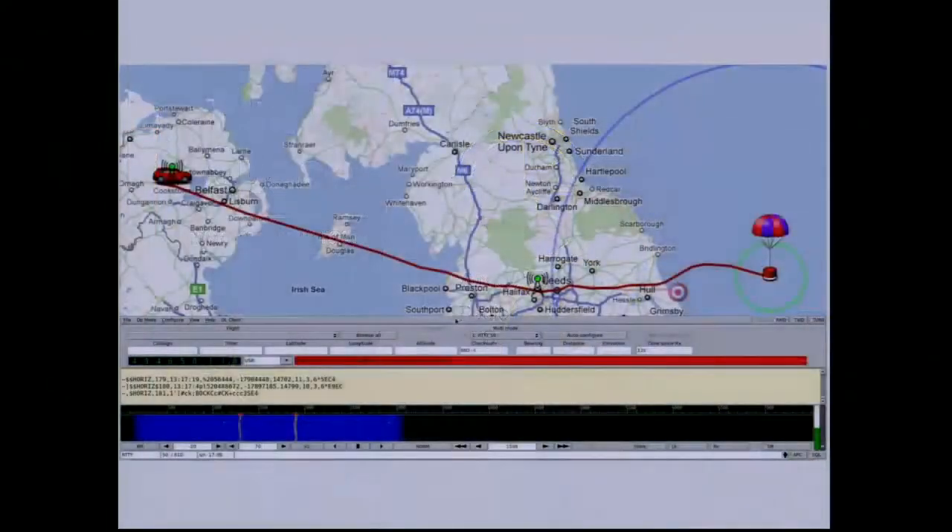This is a pretty typical shot of the tracking setup we use. This is a modified version of FL Digi, a digital mode decoder used by a lot of amateur radio folk. The top image is the tracking map. You will note that this one didn't land too well — I was aiming for Leeds. We can't use amateur radio from balloons in the UK, so we tend to use low-power license-exempt radios, which happily exist in the middle of the 70-centimeter band. But it does limit us to very low power, so sending images over that is quite difficult.